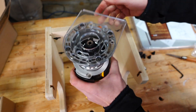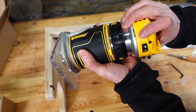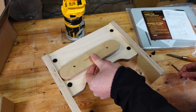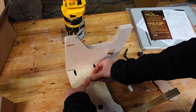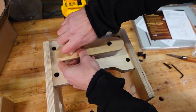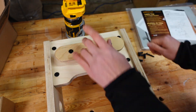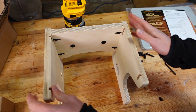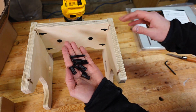We've got our little table together. With the tabletop and knowing the router is going to be mounting pretty close to flush, I think we'll be okay with probably a three amp hour battery, but probably not the five amp hour that I generally use with the cordless router. Just one last piece to put on — these neat little push-pin gizmos that are threaded. Push those on the inside, then put the spacers on and secure them. It's kind of funny that I'm attaching the cable tie when I use a cordless trim router, so I don't actually need it, but it looks nice and can act as a handle.